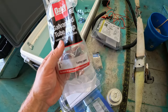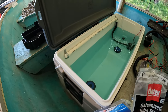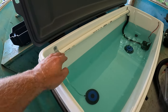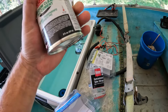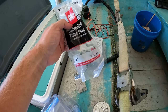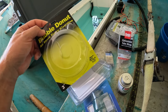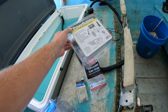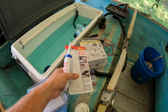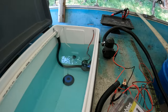For the spray bar, I got stainless steel screws at Lowe's. I went with one-inch galvanized tube straps — I had to go back because I first bought three-quarters-inch, but I needed the larger size to go over the end caps. For connecting the end caps, elbow, and adapter piece, you'll need PVC cement from Lowe's, about $9. The tube straps were about $5, stainless screws about $3. For sealing, I got marine silicone sealant at Walmart for $9, used for running wires and screws through the cooler.